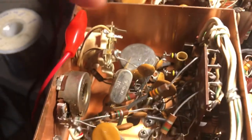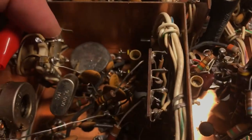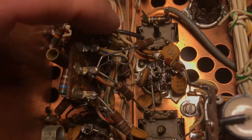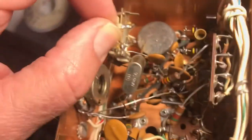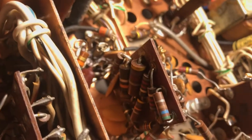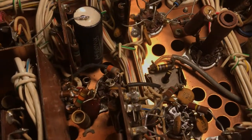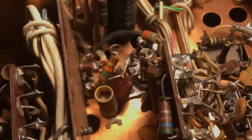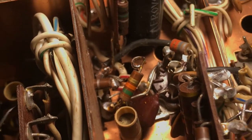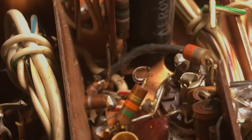In AM and CW modes the relay operates, but it would always pull in and never be out, so I figured this ground was shorted somehow. The K2 relay grounds through this pin through a purple wire, which ends up on this little board here. One wire goes to the transmit circuitry, one comes from here, and then there are these circuits. It goes through this resistor and then wires scatter off into the tubes. I kept getting resistance dancing from 20k to 150k to 3 meg, so I think it's that item down there.